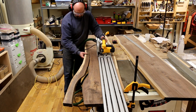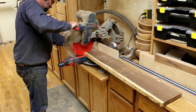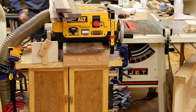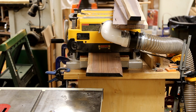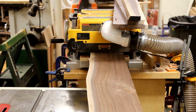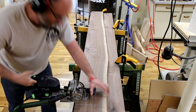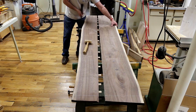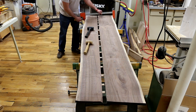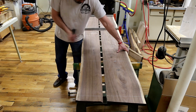Here I'm taking and ripping down that rough lumber, cutting it into multiple strips. Each of these strips, once cut down to size, are going to go through the planer. They were flat enough I was able to skip plane them nice and flat and smooth. This was also useful because the starting boards weren't as wide as I wanted, and cutting them down allowed them to fit through my planer, which the full width would not.